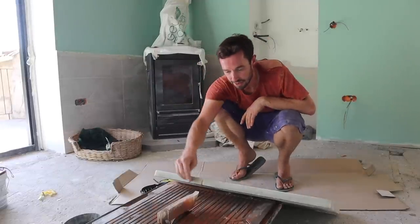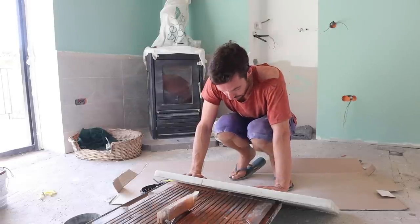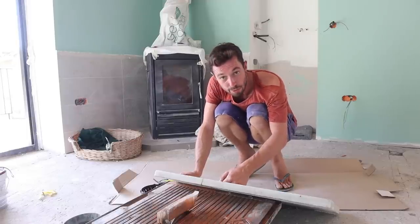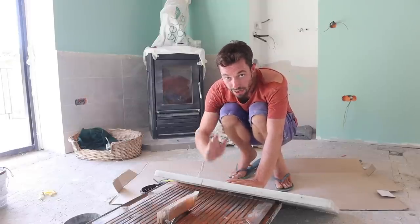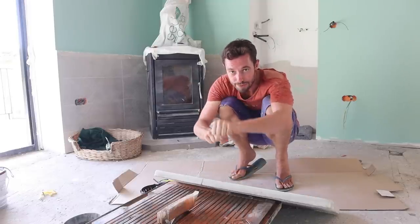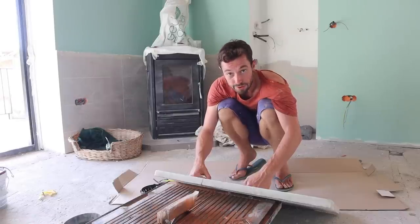The problem is the blade isn't big enough to actually cut through my marble. It's not the most ideal solution, but I think I'm going to have to use a big angle grinder — cut as cleanly and as straight as I can, giving myself a couple of millimeters grace on the line, then file it down to make it perfect. The tile cutter is great for controlled straight cuts, but the angle grinder can just rotate and burn three or four millimeters in — difficult to control and extremely powerful — but I think that's the only real option I have.